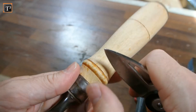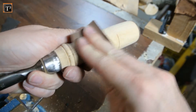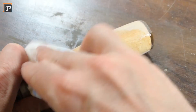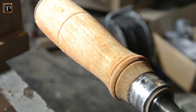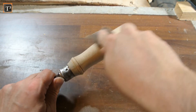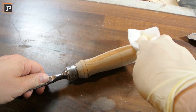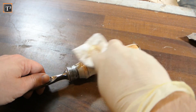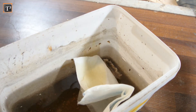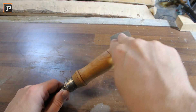Then I sanded the wood with 80, 120 and 240 grit sanding paper. I wiped off the dust with a soaking wet cloth and let the handle dry for an hour. You will find that the wood now feels rough from loose fiber ends. I used 400 grit sanding paper to get rid of them. The handle got a good coating with boiled linseed oil. Wipe off all excess and always put used cloth into water to prevent them from self-ignition. I let the oil harden overnight and gave the handle yet another sanding with 600 grit.